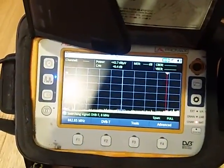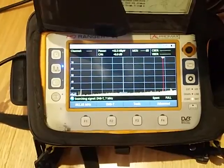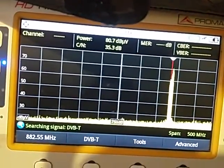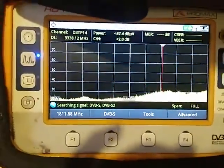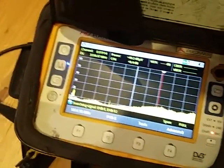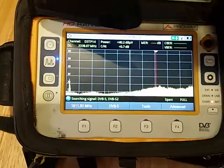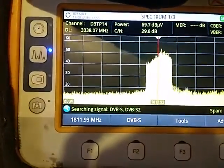I've set that to blue — blue is automatic — so it's going to be looking for the signals to repeat. We have the 3G signals back. I'm going to see if there's anything on 1800 MHz. There's nothing there. Let's select 4G — the green setting — and there we go: this is Telstra 1800 MHz 4G, which they call 4GX.